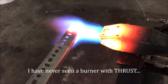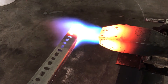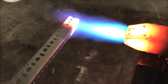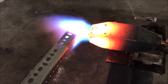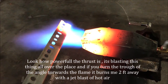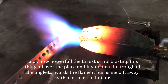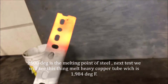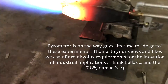Essentially, what's most important here is that we are mixing propane with a supersonic jet of air — basically an annular jet of air. The process of doing that changes the rate of combustion by exposing the fuel to fresh oxygen at a higher rate of speed. So within any given increment of time, we have exposed more fuel to more oxygen because we are force-feeding it.